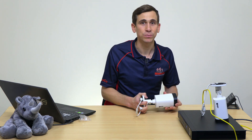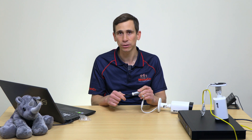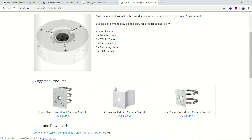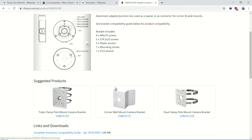Once this is installed, if you can stick it into a wall cavity or somewhere that's going to be protected from the sun, that's great. If you can't - say you're mounting to brickwork - what you should really be doing is inserting it in a housing or back box, a junction box. For this bullet camera, there's a waterproof housing unit that gives you that extra layer of security. Really it's just any back box that's going to protect the connector so that it's not exposed to sun or running water or hoses.